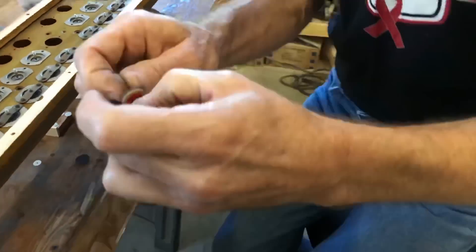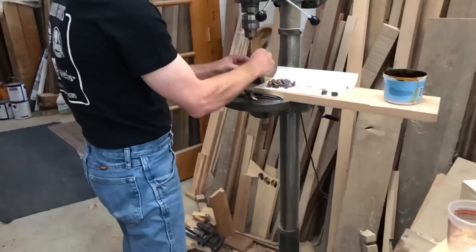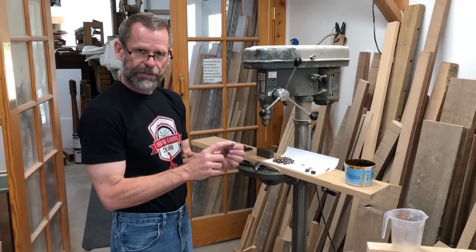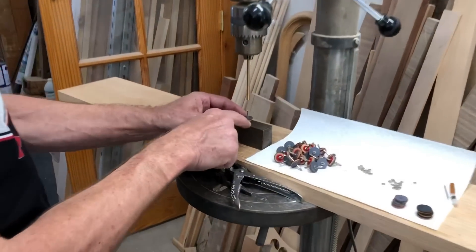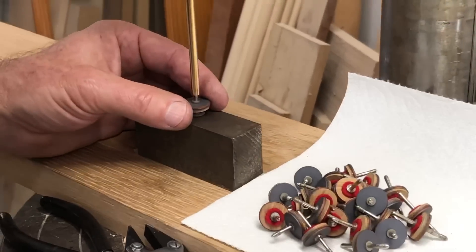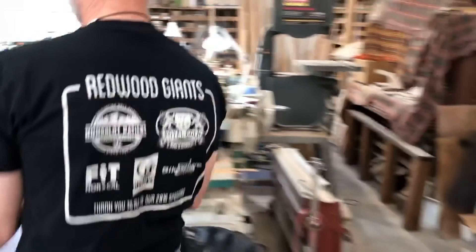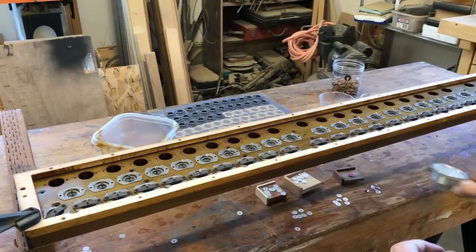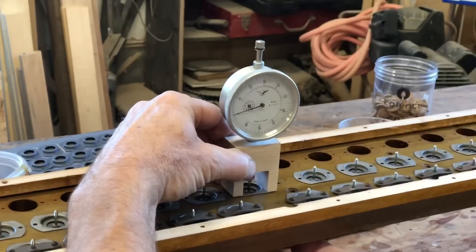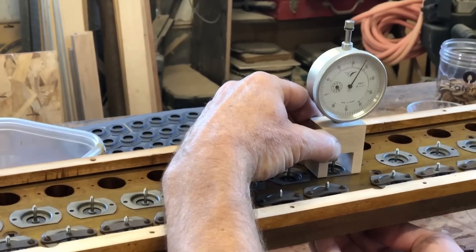What we'll do is pop it out, remove the upper valve seat, and I've got some little spacers made of mylar — each one is about five thousandths of an inch thick — so I'll put two spacers on here, which gives us ten thousandths of an inch. Now we'll go back to the press, and with those spacers on there it's going to force that collar a little bit closer. Now we'll go back and give it a try. We're very close — my goal is to be between 35 and 37, and we're at 37 right there.